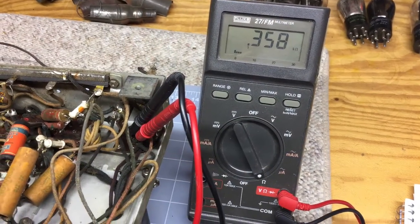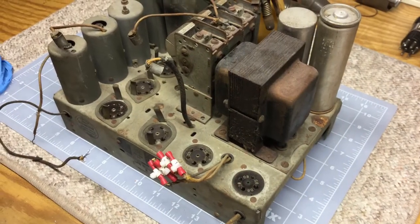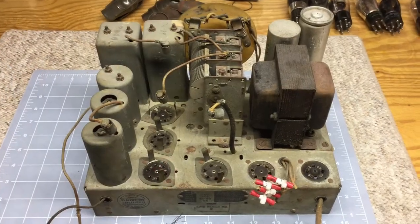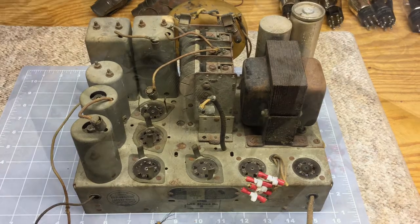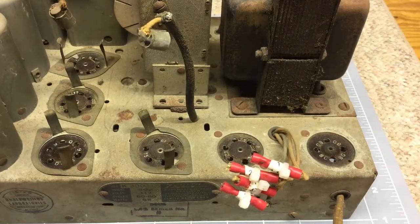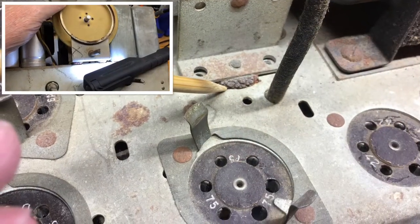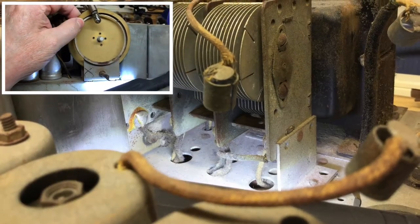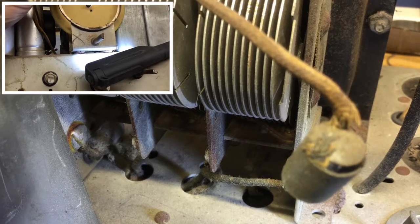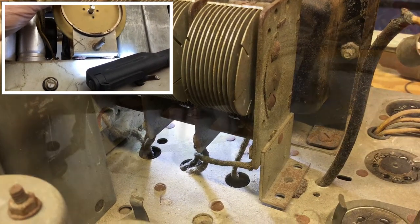Here I'm doing a quick check on the transformer, which I'll definitely double-check when I get it out of the chassis. But it checked good — went through all the windings and everything looks normal. The old tuning condenser has seen better days. Aside from the rust, those grommets that hold it in place are in really bad shape. Here's a picture-in-picture clip to show how much movement there is in the tuning condenser — you can see how much it moves around. It's crazy. All the hardware is tight; it's just the grommets or spacers that are completely worn out. I'll fit some new ones and rig something up to give it better support.